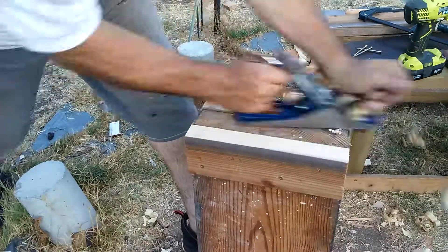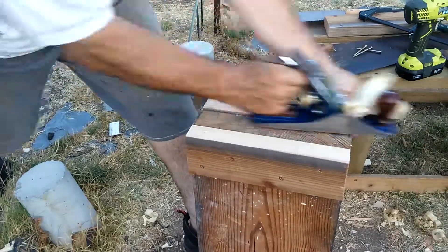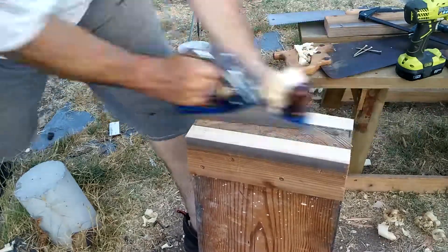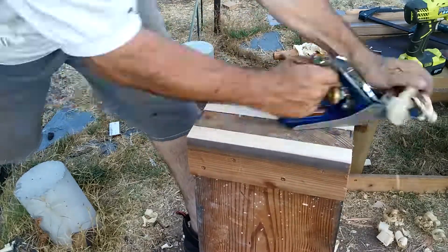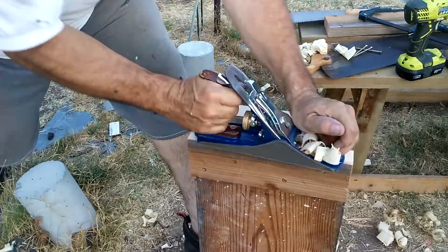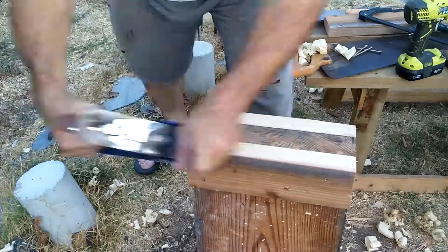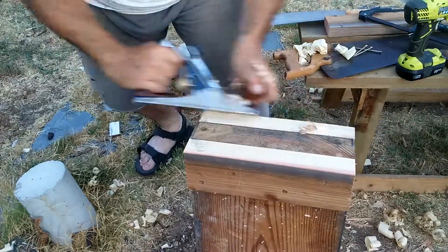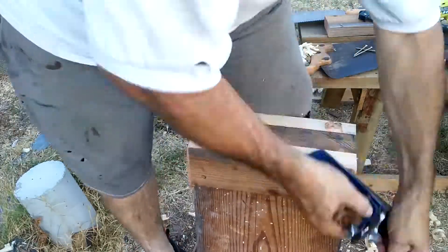Planing is not a difficult thing when the wood is soft like this. And while I say it's redwood, it's turning up awfully white in the picture, so I'm thinking it might have been hemlock or something like that, because it's certainly not pine — there wasn't enough knottiness and stringiness in the grain. But it cleaned up very nicely, and I chamfered the edges to keep them from splitting as I used the object.